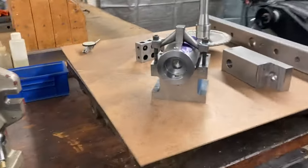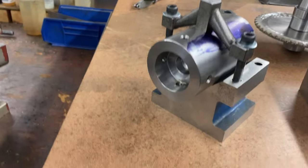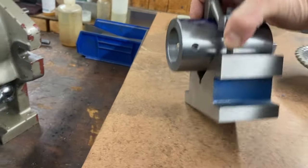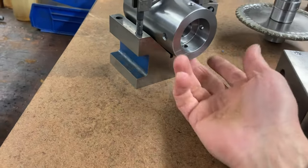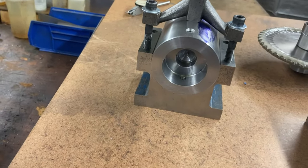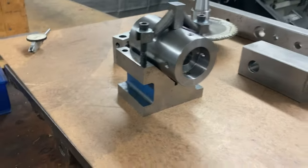So how am I going to do these things? We got options. If I was doing one piece, you could do it in a V-block — top hole, side hole, side hole — you'd just have to indicate it every time. No big deal for one piece. But I got a bunch of them to do, so V-block is not a good option.